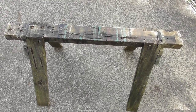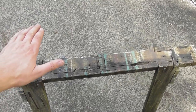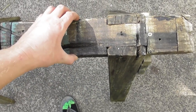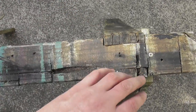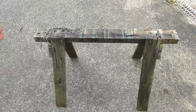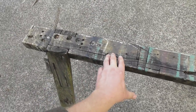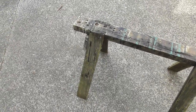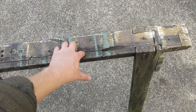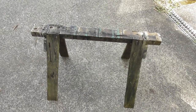I want to make a few improvements on this classic design. First, it's got to be taller — these are way too low, I'm too tall for that. I want them to be about another 10 inches, or 200mm, taller. Wider too — four by two is not wide enough and things fall off, roll off, or tip off. So I'm going to double the width to eight inches. I'm also going to make them a bit longer and more sturdy. And I'm going to use treated timber so the whole thing doesn't rot — most you buy here aren't treated and they go to shit fast if left outside.